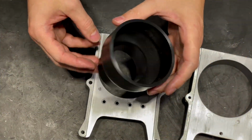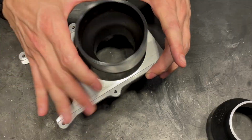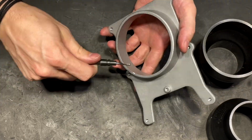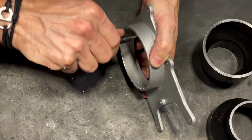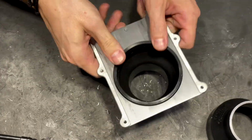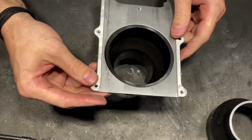I need to adapt the size of these blast gates to fit the vacuum piping in my workshop. Unlike a traditional woodworking dust extraction system, which is high volume, low under pressure, my shop vac produces a vacuum that is an order of magnitude higher but has less volume, so you can get away with smaller diameter piping.